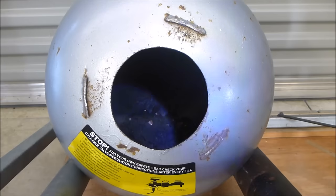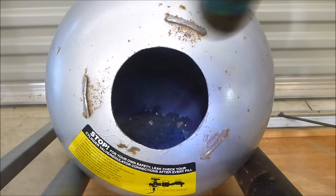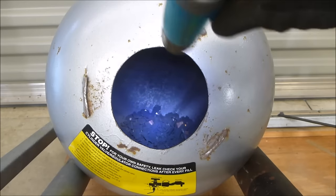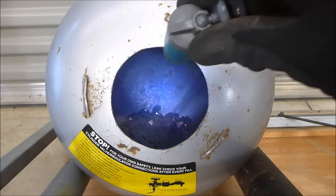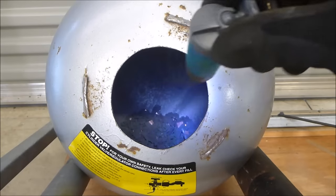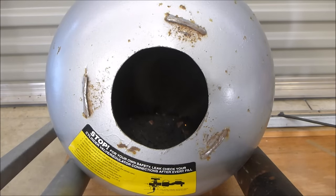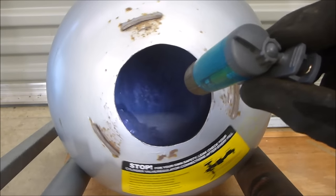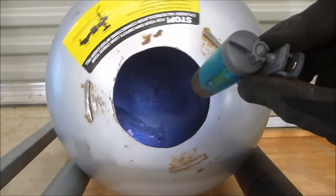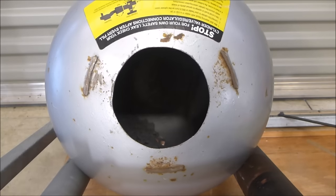Let me show you what happens inside the ball mill with no ball in there — I just want to show you the way that the chips slide, and you'll see why you end up needing those fingers. Rather than using a piece of angle iron or something in there to grab the ball, fingers work really well because they allow the chips to slide through while they actually grab the ball. I'm going to turn this on — it might be a little bit noisy. You see the way that the chips are sliding? There's going to be very little milling action that's actually going to turn them into powder — you'd need a year or two of sliding like that to have any effect.